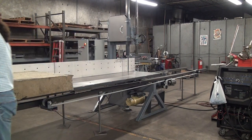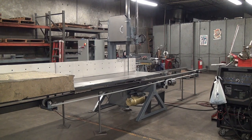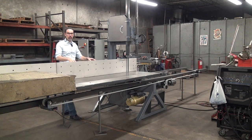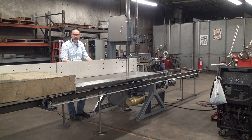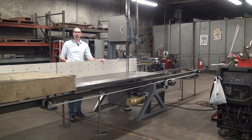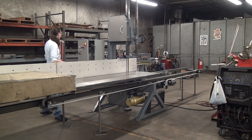Setting up for a cut — I'll shift it over just enough to make a little nibble of a cut. The blade I'm using today is a one-inch wide, three-tooth-per-inch blade. It's a great do-all blade and it'll cut this material like butter, though it is going to make a little bit of dust. Another option would be a one-inch wide scallop edge blade, which would cut this material with pretty much no dust — but for a quick demo cut, I just want to illustrate the concept.